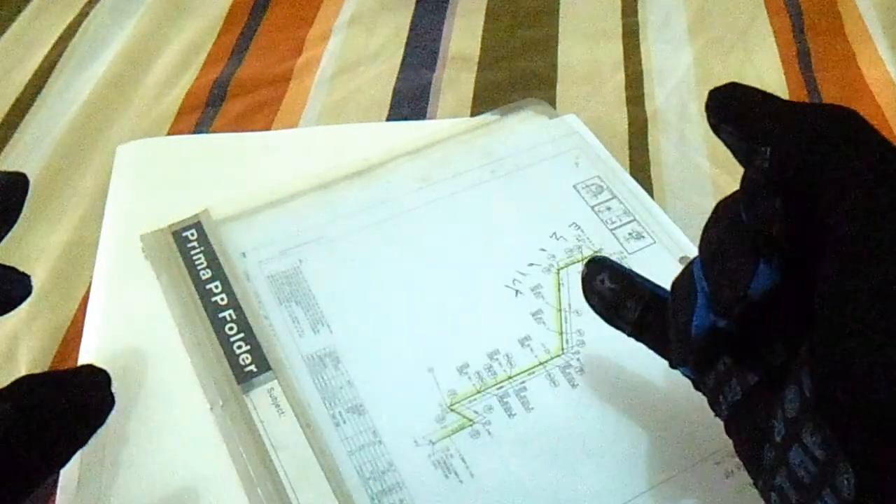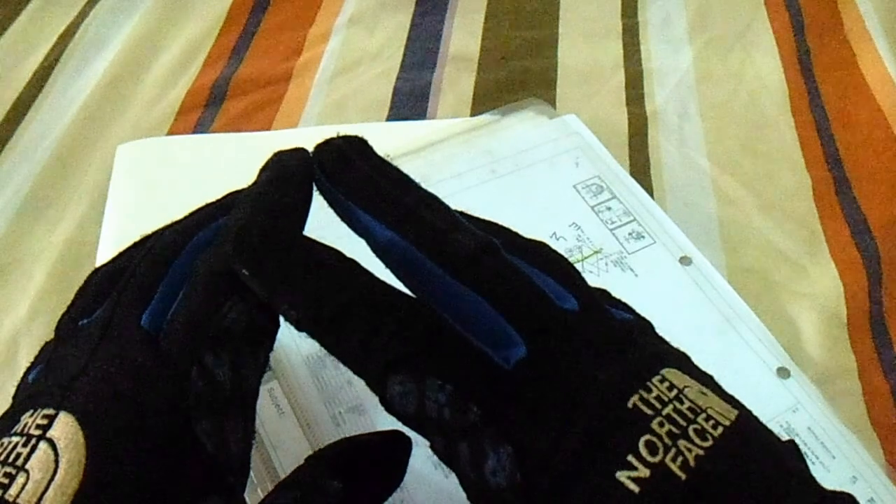Pressurize at 50%, then 70%, then 100% — not directly to 100%. First 50%, then at 50% all joints shall be inspected. If this is pneumatic, use a swab or soap spray on all joints. Also, the inspector must do line checking during testing.